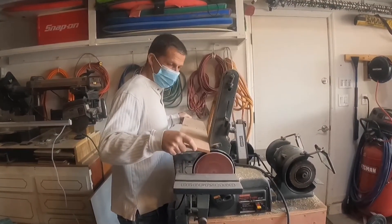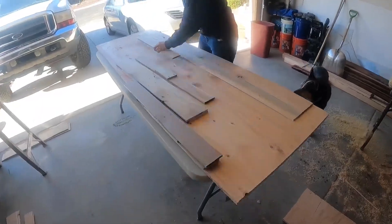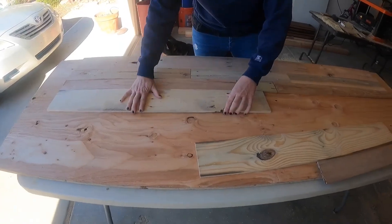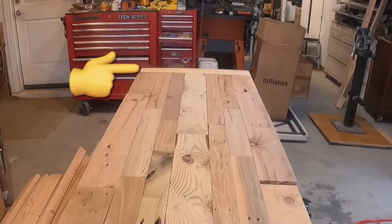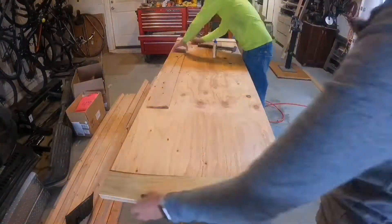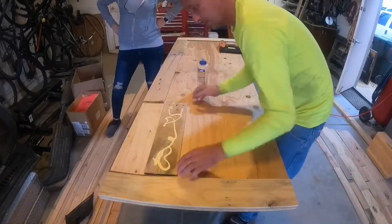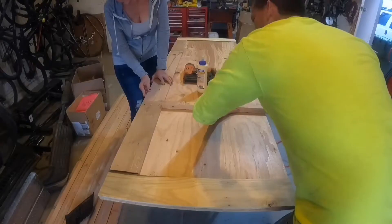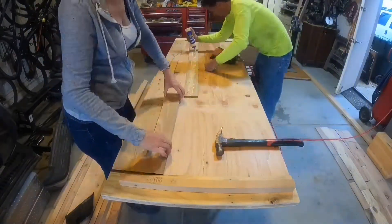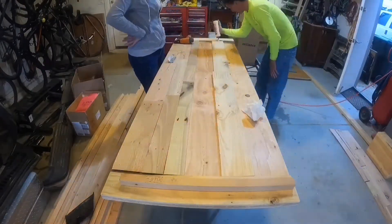I had to take a sander to a couple of them depending on how crooked the boards were so they would cut well on the table saw, since at this point I do not have a joiner. Once we had it all laid out on the table, we took it all apart and put a piece of plywood underneath it and set it back in place. We decided to put a couple pieces of pallet material going the opposite way on the ends. Once we made sure the plywood was the right size, we pulled all the material off, cleaned the plywood off, and began to glue and tack nail the pallet material onto the plywood. We were going for the rustic look, so I tack nailed through the pallet material into the plywood — however, if you didn't want the extra indentations, you could go from the plywood side into the pallet material.